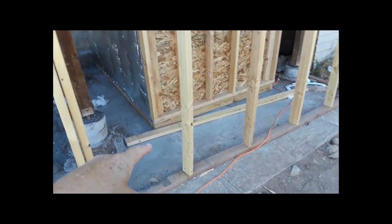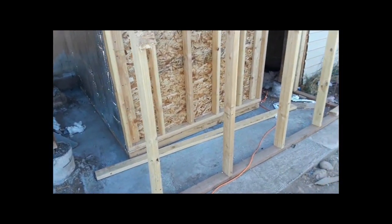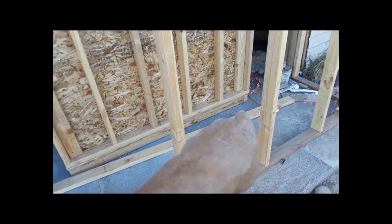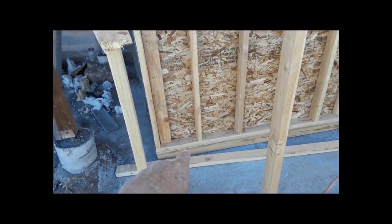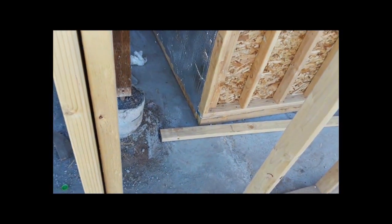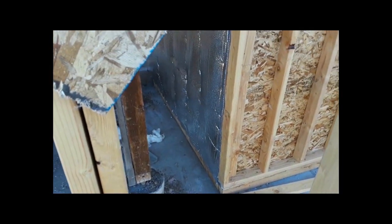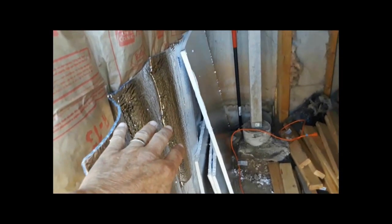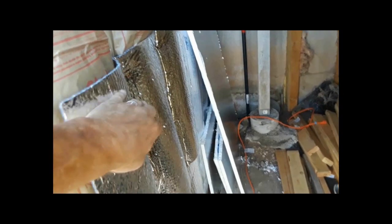So if you remember, there's the bottom frame that we had some good close-ups on. I didn't film assembling this tank much, but as you can see these walls were built separately and then laid right on top of that bottom foundation. On the other side, the same thing — that's the bottom footing or foundation. I've put insulation on the outside here because this tank will hold hot water, and outside the insulation I've put this silver metallic reflector material and stapled it to the walls so it'll stay. That should insulate the tank quite well. I've done that all the way around — I still need to do this last wall since I just got it up yesterday.